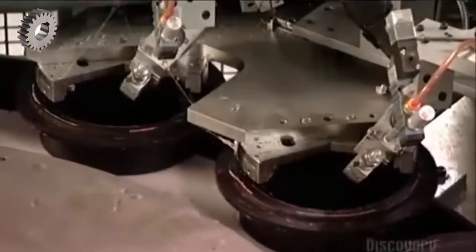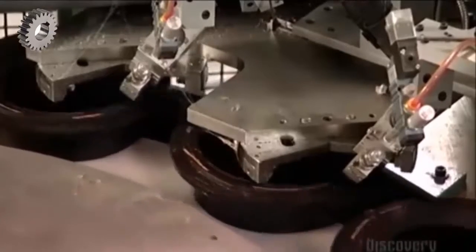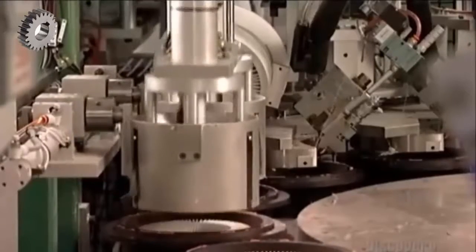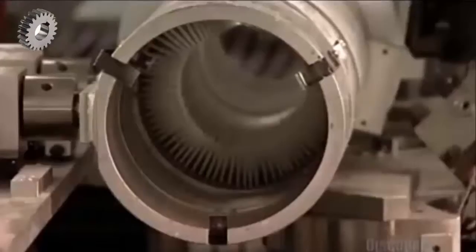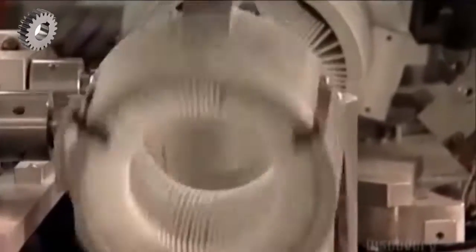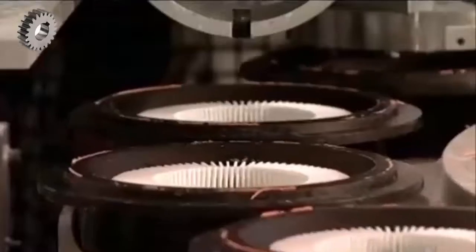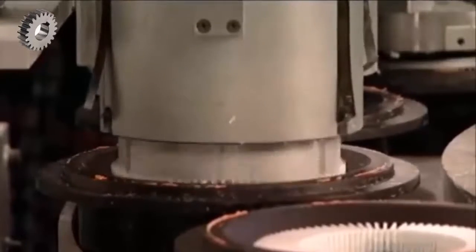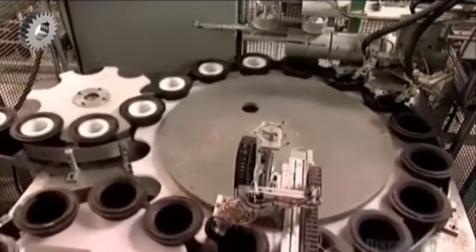Then, a pneumatic pusher raises the caps and nozzles dispense a hot glue bead onto their edges. Another pneumatic pusher tool forces round packs of pleated paper out of cylindrical holders and into the molds. The big wheel keeps on turning, positioning the molds to receive more packs or tubes of filter paper. The wheel pushes the paper-filled molds onto a conveyor belt.